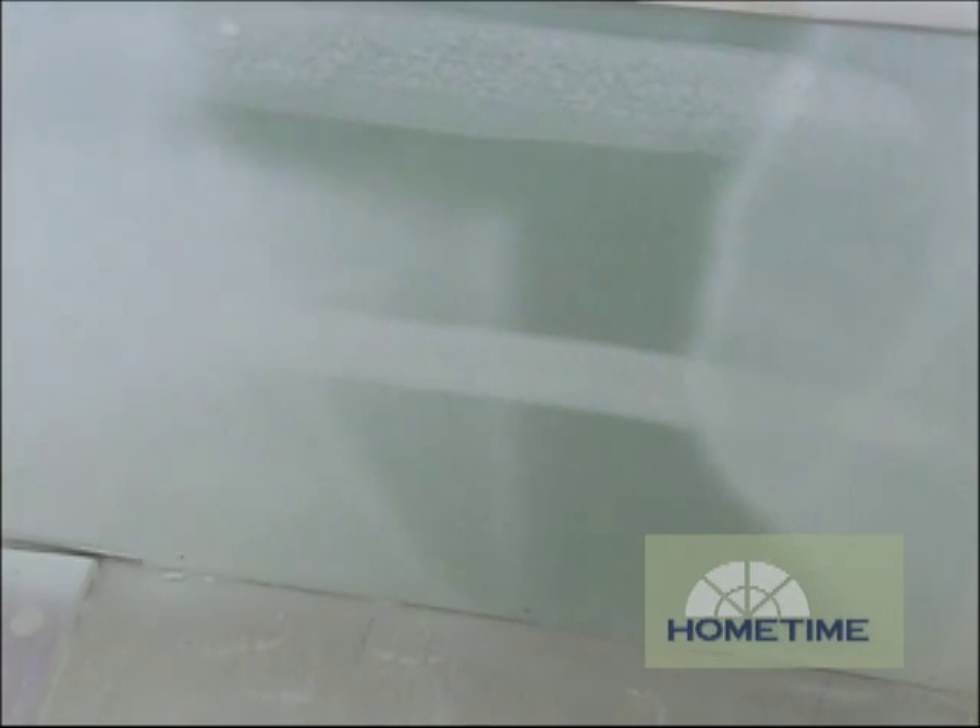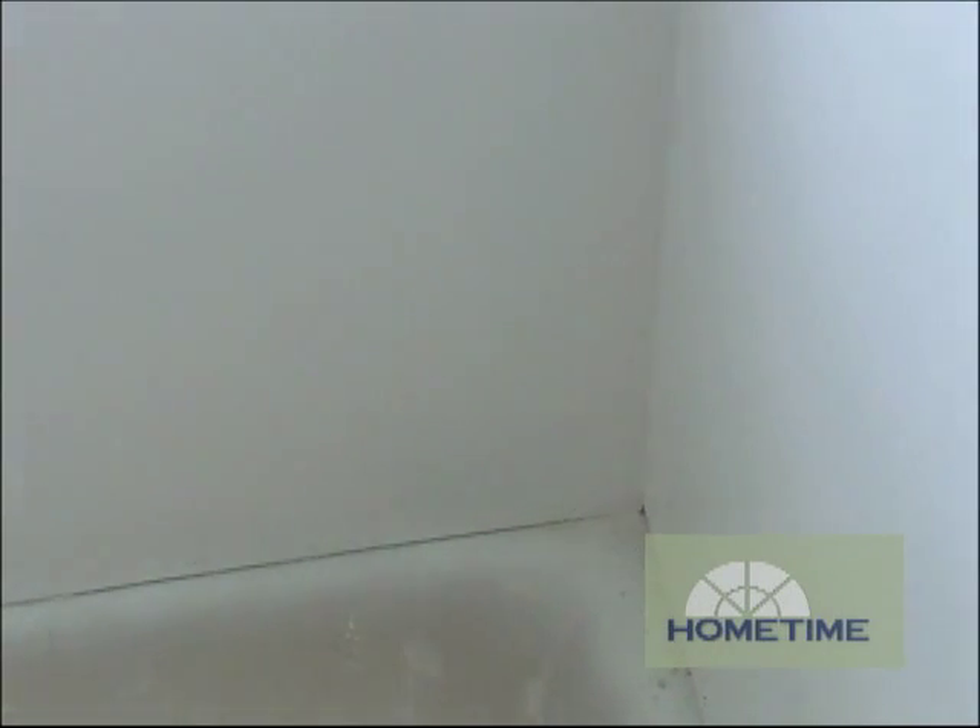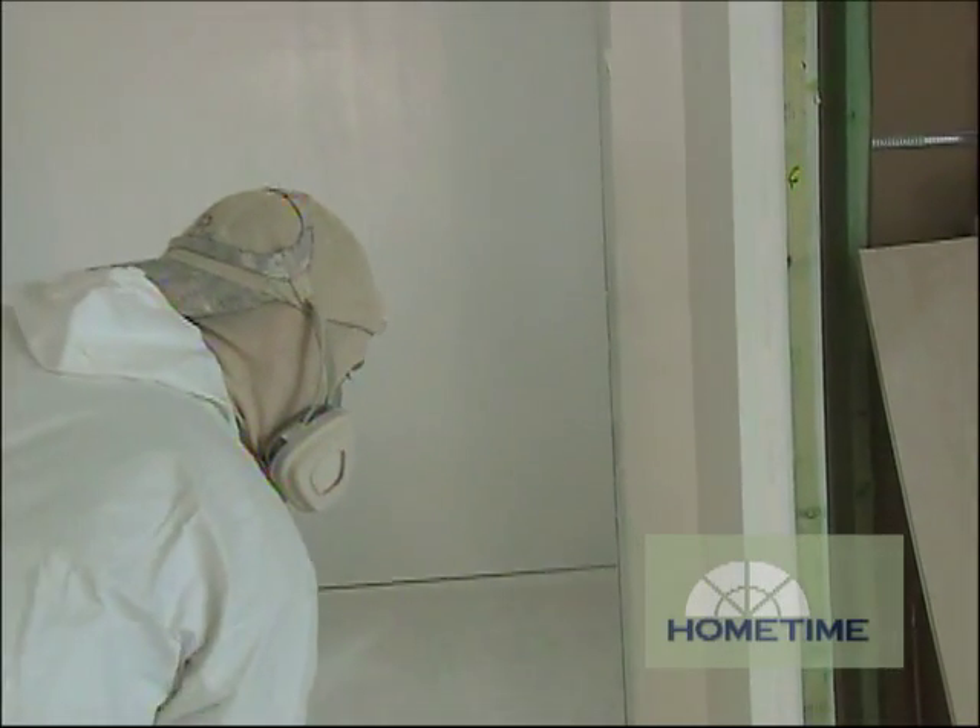It's a lot different than most paints and primers in the fact that it's a very heavy material, so you really have to take your time to put it on properly and make sure you're getting a nice uniform coat. In this case, it's the painters putting on the material, and it goes on so thick and smooth that it qualifies as a skim coat, which will take care of any banding.